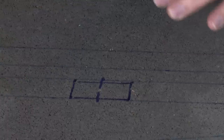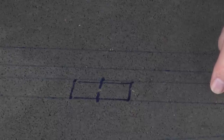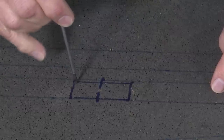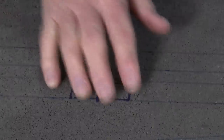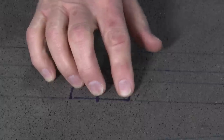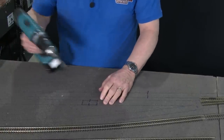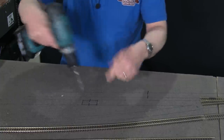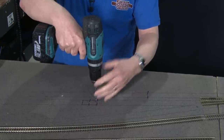No big deal — we'll use a jigsaw, having checked that the underside is clear. When you want to start a hole, you need to drill a hole in here and a hole in here first, because once you've got the hole there, you can come along and cut the rectangle. You make less of a mess that way. I'm convinced we're clear underneath — I just need a drill, and the drill needs to be slightly bigger than the jigsaw blade. If you don't own a jigsaw, it's no big deal — just drill holes every couple of centimetres and then get a saw and connect up all the holes.